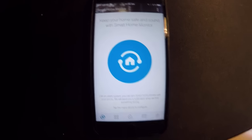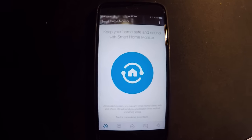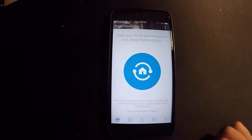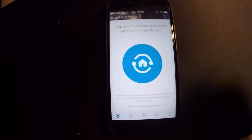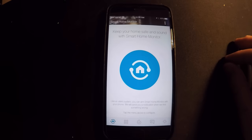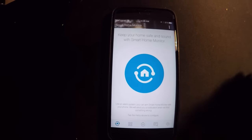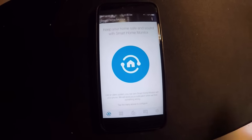Lastly, we have the smart home monitor. This is SmartHub's plan of action for monitoring your house as an alarm system. You can set up Z-wave sirens to automatically go off depending on if windows are open and closed and you're not there. Only when you're home, you can have it disable your security or whatever else. If you invoke the 'I'm going to bed' activity, you can engage it and automatically do the routing. There is some elbow grease involved here — you're going to be sitting down and thinking this out. Probably the best way to do that is to get a pen and paper and map it out: if the front door locks at night when I invoke the bed mode, or a window opens at night and I'm already in bed, alarm the siren, bounce me a notification, you can fill in the blanks.